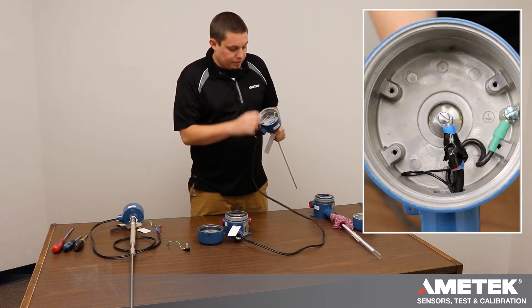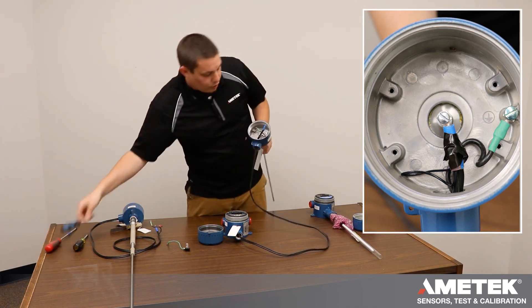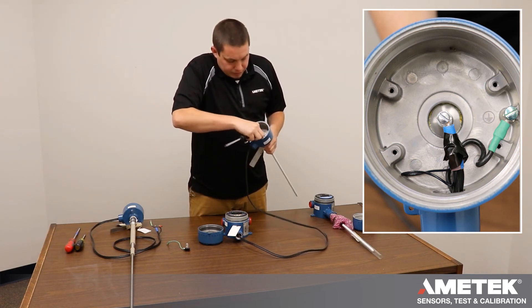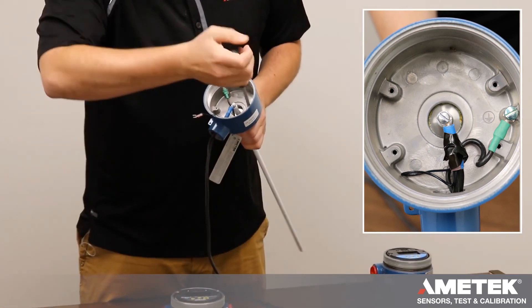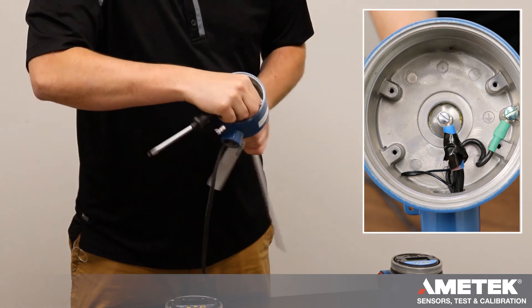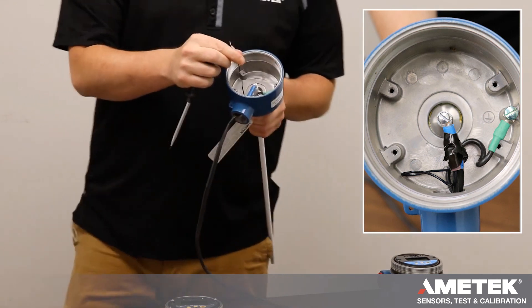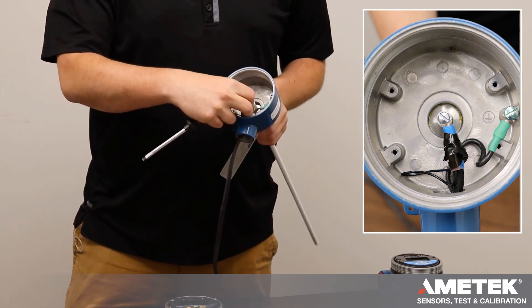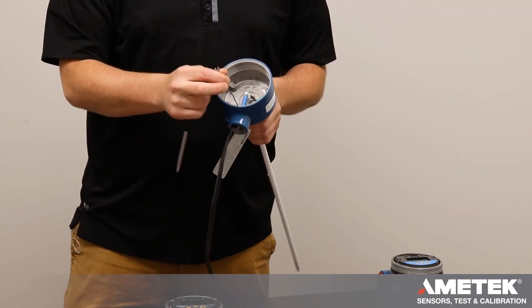To wire a two terminal, you take the interconnect cable and insert it into the housing. The blue heat-shrunk end will go onto your probe, which will be the blue screw. The green ground wire, also heat-shrunk with green heat shrink, will be wired into the condolet. The shield wire can either be clipped off or taped onto the cable itself — as long as it doesn't short against the blue screw or the green wire in the condolet, it needs to be isolated.